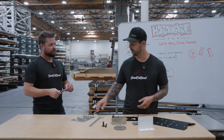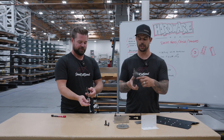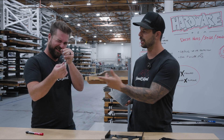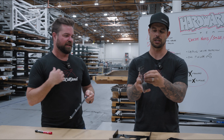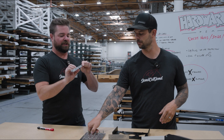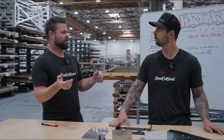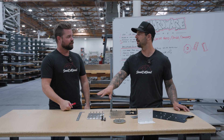One thing to consider and avoid: when you have a lot of pressed-in hole operations really close to each other, we're putting so much pressure and deforming these areas that we're actually expanding the metal outward. You can start to get warpage in your parts — especially in long skinny geometry. It's similar to using an English wheel; you're starting to stretch that material non-uniformly. You'll see this less in thicker material than thinner material.